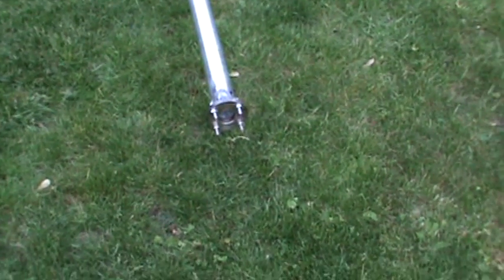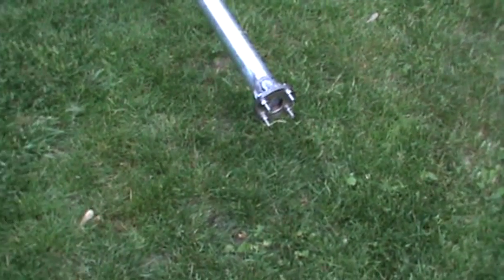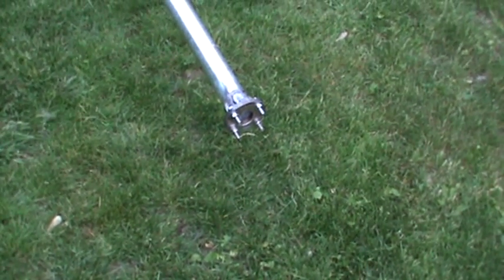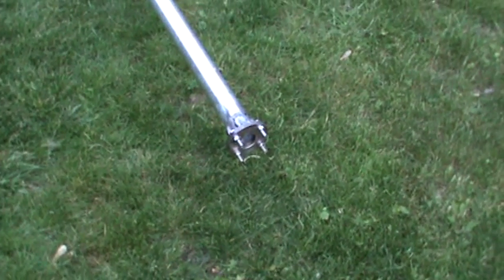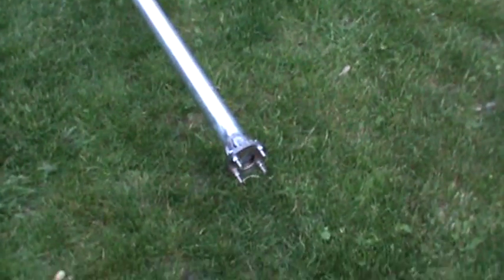Here's an update: Trex called me and told me the flange was welded on the pipe. There's the flange ready to go. He cut out some brackets, welded the brackets to the flange, and then the brackets to the pipe, because the pipe is schedule 40 — quite a smaller thickness than the flange itself — so it was a little tricky.